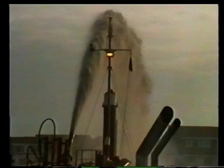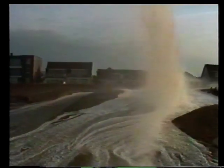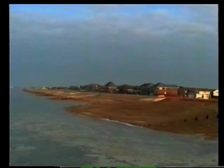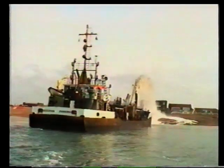The dredger is able to make 3 trips over each high tide, carrying about 600 cubic metres of shingle per trip. It took 10 days to complete the movement of 25,000 cubic metres of shingle, working 2 tidal shifts each day. 1 shift was lost due to bad weather. The difference between the recharged groins and those that were not filled is clearly visible. Within 5 days of the operation being completed, the fences were taken down and the beach was being used by visitors.